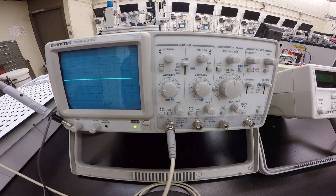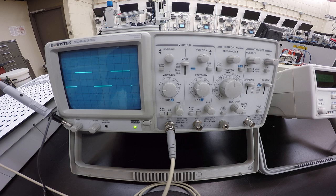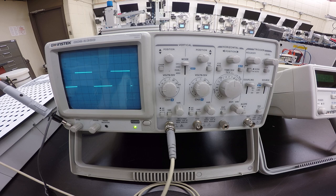Once you've lined up with the x-axis, press the ground button again and you should see a square waveform of 2 volts peak-to-peak. We're on 1 volt per division, so each solid line is one division corresponding to one volt. Using the x-axis as the reference, going up one volt peak and another volt gives us 2 volts peak-to-peak.